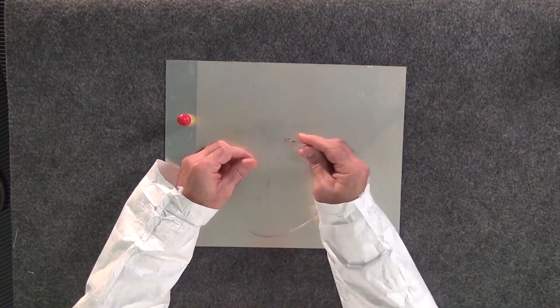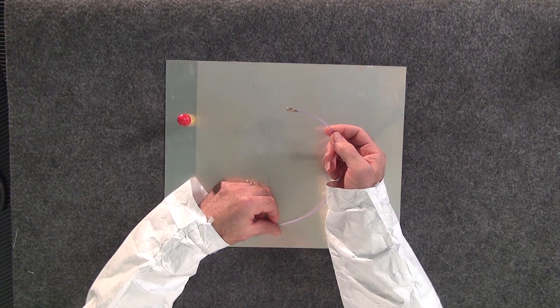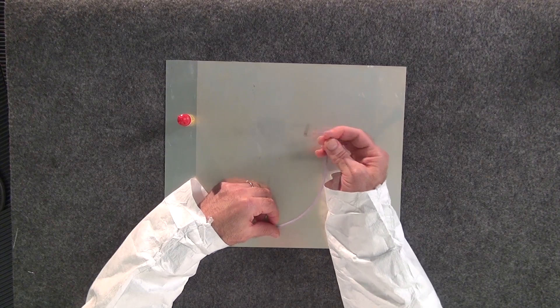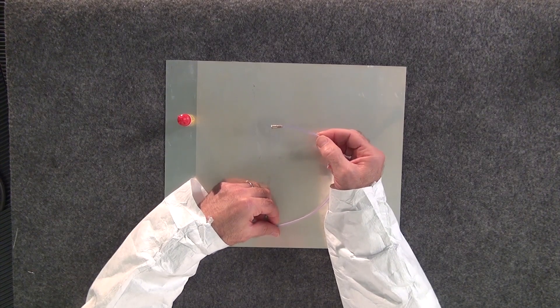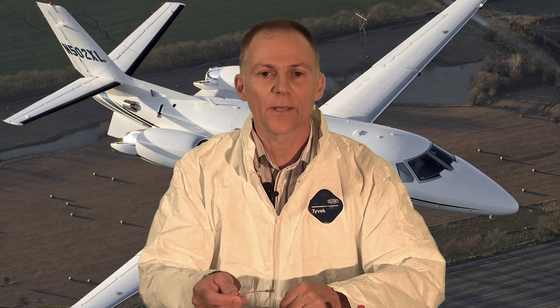It's quite simple and a real time saver. Another tip: if you feel the string technique is too flimsy — kind of like pushing a noodle — you might want to attach some heavy safety wire to do the fishing as you go through a small hole, or even bring some of the skin back just a little bit, a fastener or two, to get it in place. Push the fastener in there along with the safety wire, and then pull the safety wire off once you get it through the hole.